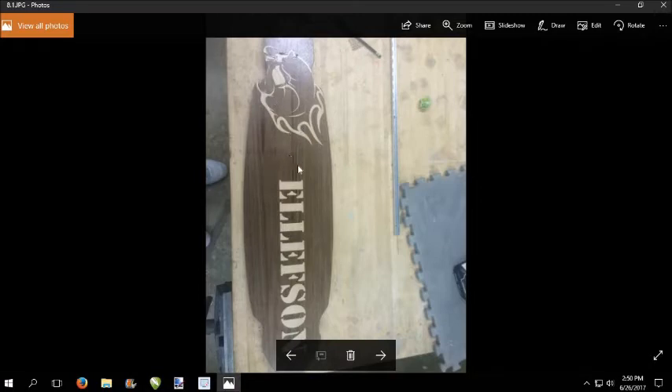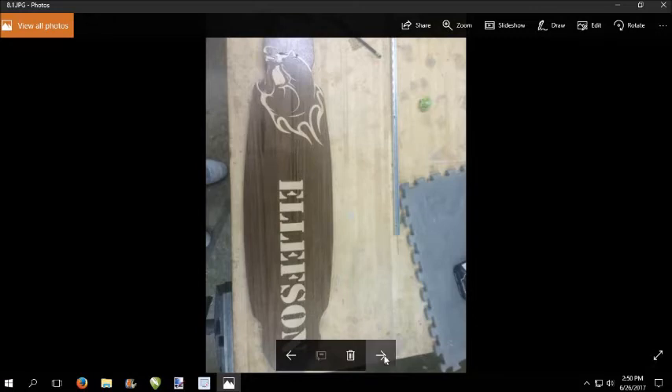The other thing I wanted to show was the transition. The 40-inch board can't fit, so he took the veneer and cut right here. While he did line up his pieces pretty well, the grain lines look good but they're not perfect — you can always see the line. So while that kind of transition does work, it's difficult to make it look good. That line will always be there. This is an example of somebody that took a lot more time; the cut is about here, and it's really hard to see. He did a very good job keeping his grain lines lined up and making it a tight joint so you can't see it.